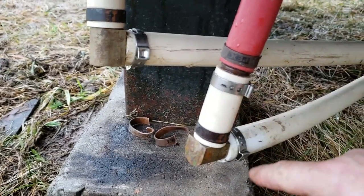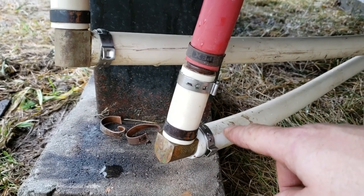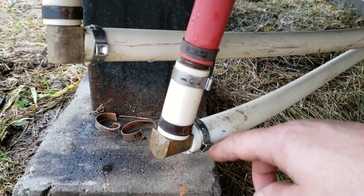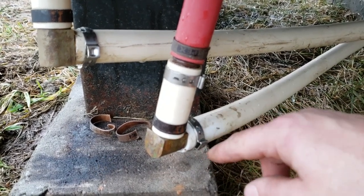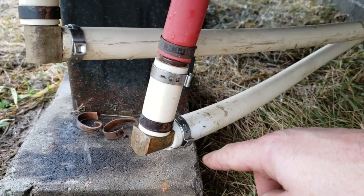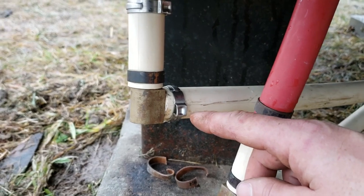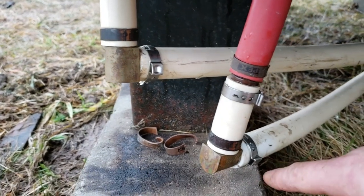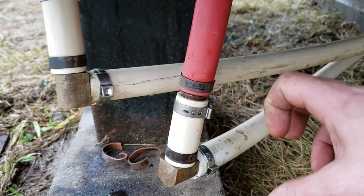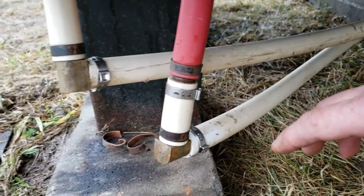So I don't know if these... This pipe is really old, so it's very brittle. I noticed when I did the 3/4 inch PEX, the fittings work pretty good. These little cinch clamps or pinch clamps, but on this 1-inch, it just doesn't really pinch all the way closed, and it doesn't seem to make a good connection. So these drips may stop once everything warms up and settles in, as there could be some tension on this. These pipes are really stiff when it's cold outside.